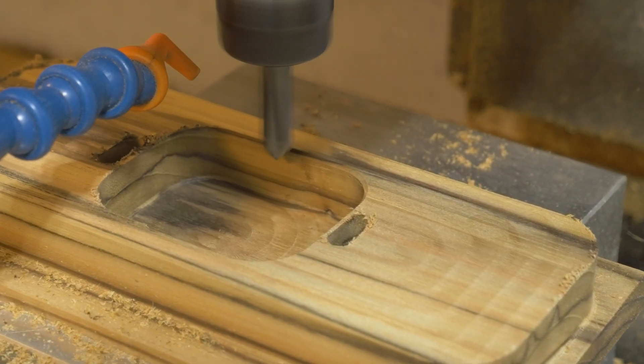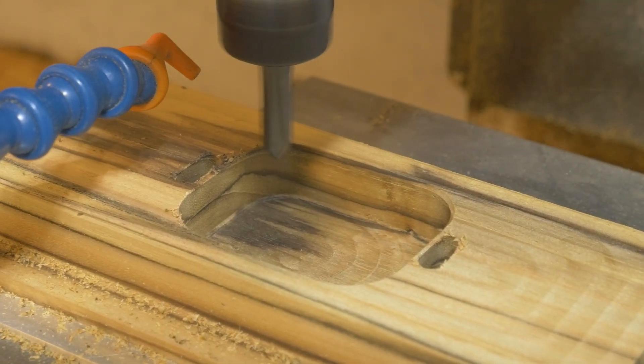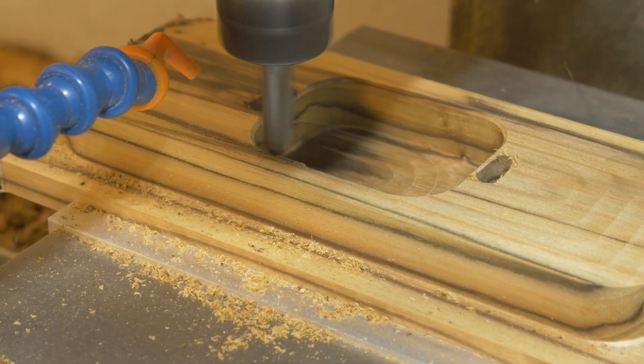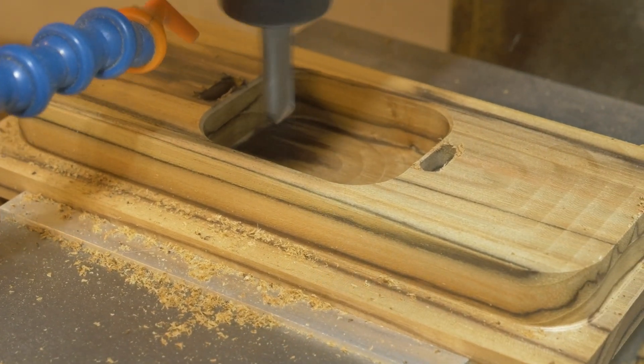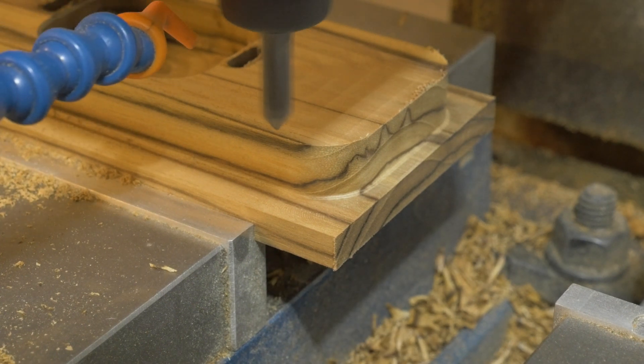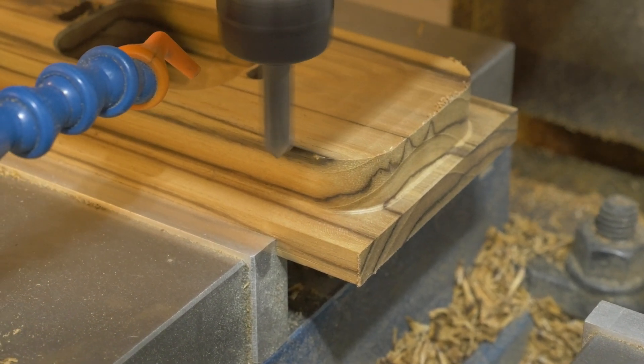The corners look really, really good in wood and you can go quite a bit faster. This is I think four thousandths feed per tooth. I like to go a little bit slower on the finishing passes, so with chamfers, 2D contours and things, I'll always go a little bit slower — just err on the side of caution to get a nice surface finish.